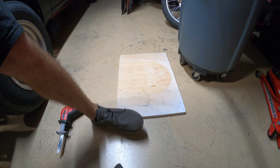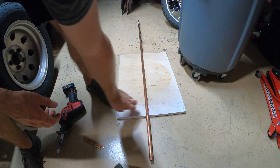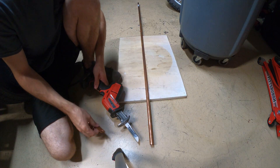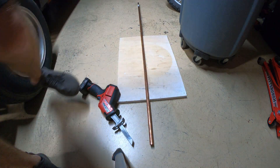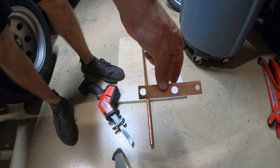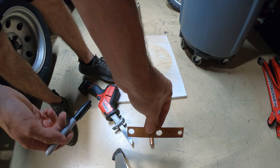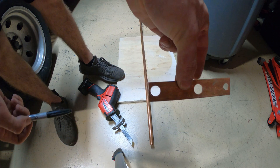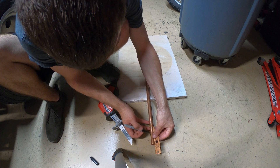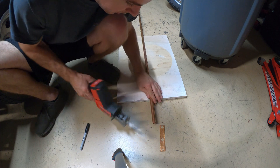All right, now we're in the garage. We've got our copper pipe, so we're going to cut it down to length and start making our bus bars. These bus bars are what connect the original cells, and this is where the terminal goes. I'm going to make one half the size for the second set of cells and then another one to bridge it to the first set. It'll make more sense once I get them built, but first things first we'll go ahead and get this cut.